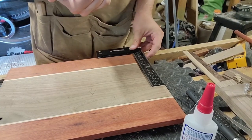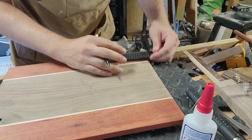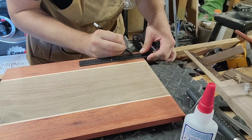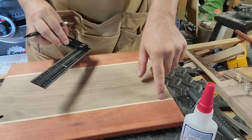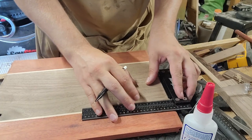On the face of each screen I marked out spots to drill holes to embed some more magnets to attach accessories like acrylic screens or the iPad holder I'll show in a bit. It was simple — I just marked a half inch from the bottom, then an inch and six inches from both sides, and repeated those same measurements up eight inches from the bottom, which happened to be exactly where the walnut and the maple met.